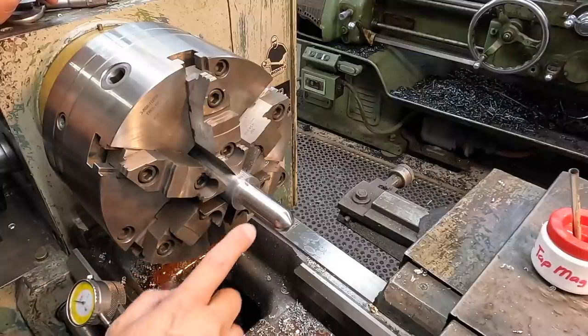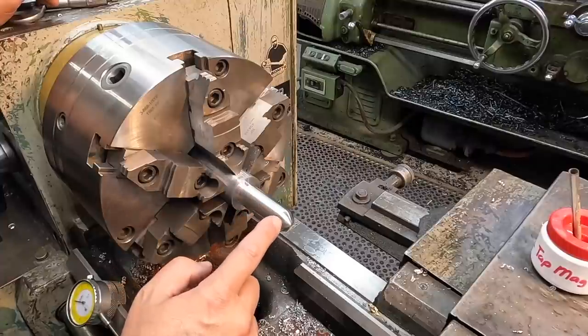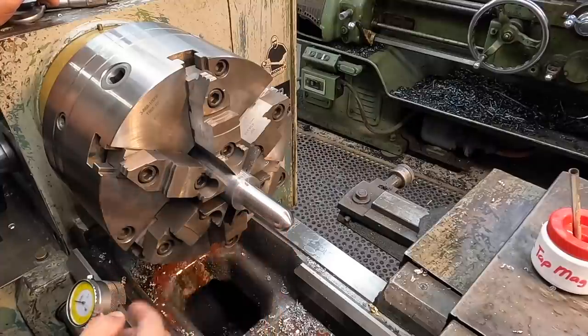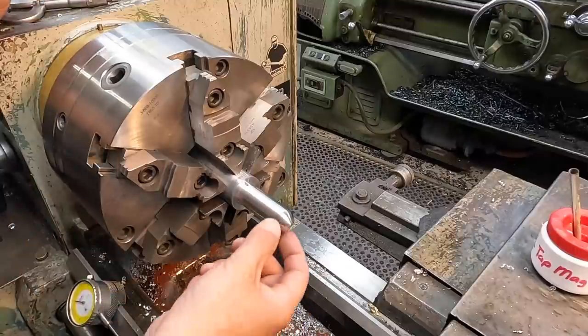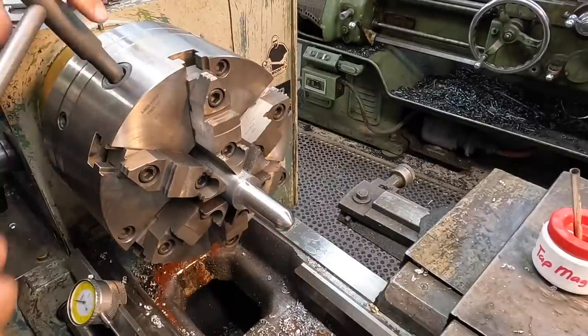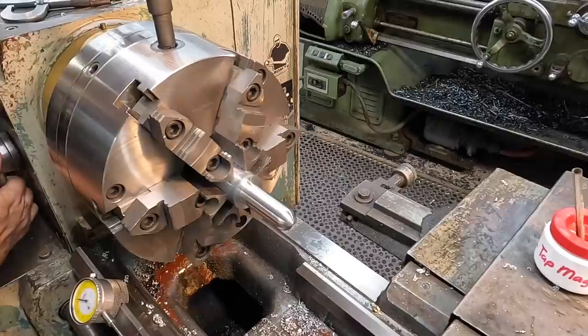So what I do, once I turn this down, I just go in here and blend this radius back in there to make the whole radius complete. And it's nothing critical, it's just a nice radius that matches the diameter of the rod there. So that's what we did. So we're gonna go ahead and turn this around